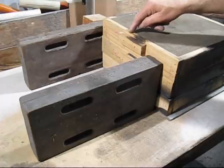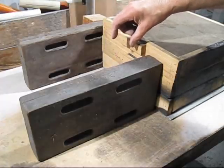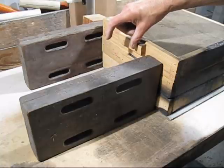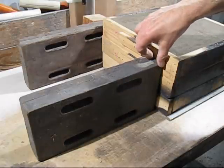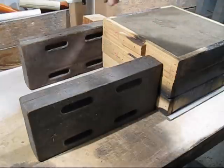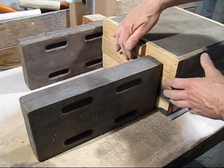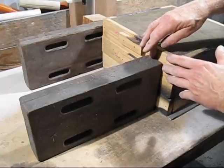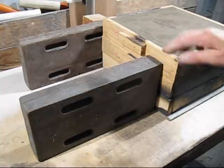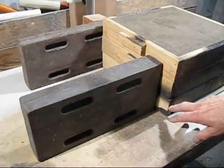This is the problem with this box. The pins are only about that long and it's got to clear about that much in the depth of that angle plate. So this is an old trick I used in one of my earlier videos. You put a lump of cast iron here and a lump of cast iron here. And what happens is, when the pins release, as long as you're pushing a little bit in that direction, you're lifting it up, and you make up for the lack of length of pins, and they should guide you until those two boxes are free from the bottom.